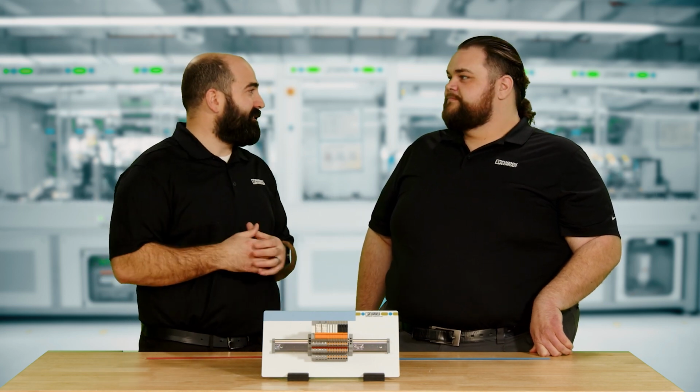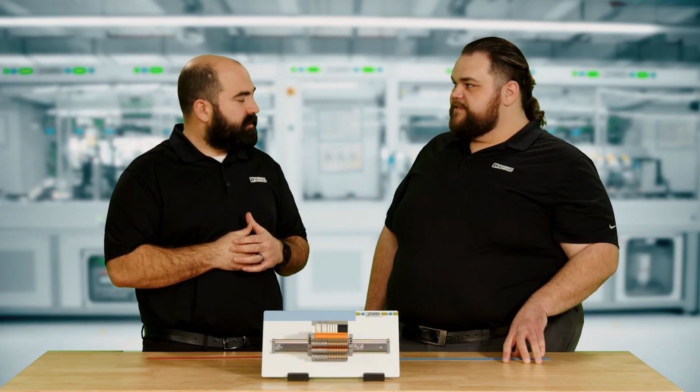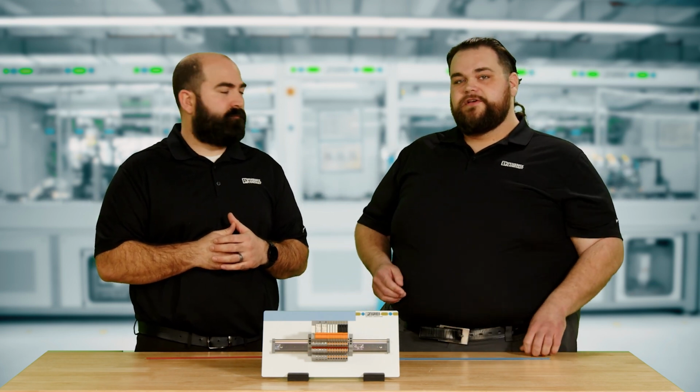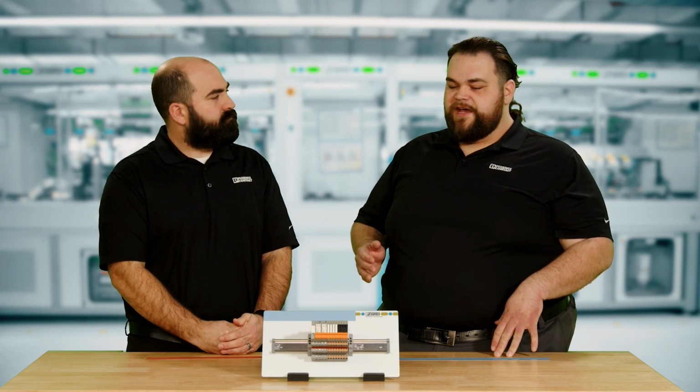It's less inventory, less products to have. Absolutely. It's just a simple bus bar system. So you talked about up to 80 relays. And if I'm thinking about relays, they're limited in how many amps they can really have. So do you have a way to bus some more power to all of these relays? Yeah, that's also a great point. The competitive finger bridges rely on the rating of the terminal of the relay that you connect it to. So our relay, just like anybody else's on the market, is typically limited to 6 amps.